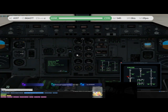Again, analog and digital. In the Airbus 320, all of this is on the screen. But here you've got the bleeds, vibration, fuel flow. Now, what caused it to do that? Anybody know the answer? That's because the number two generator came on. And it causes the electrical to fluctuate.